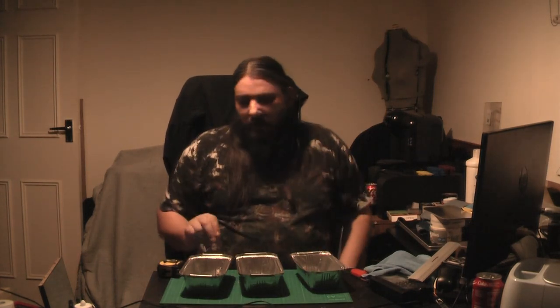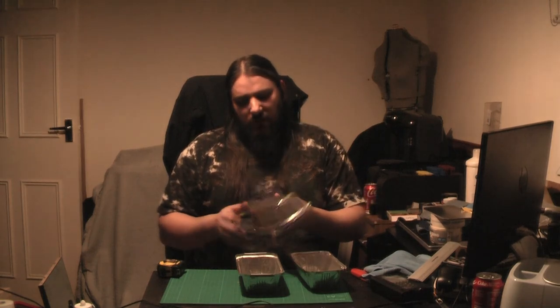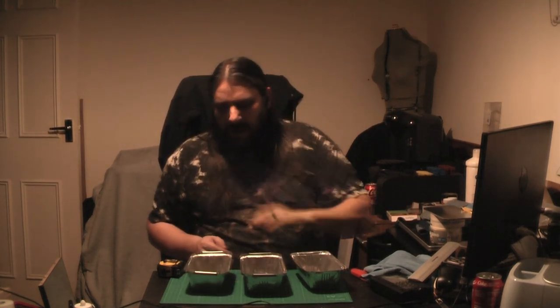Now, this isn't the ideal way of doing it. Absolutely not. It's corrugated. You've got a pattern on the bottom. This is not the way to go. You can mitigate that somewhat, but you will need to surface this because the base won't be perfect. The sides won't be perfect. Nothing about it is going to be immaculate. So if you do go this route, it is the cheapest route, but it's going to mean more labor. You know, if you can get glass and do that, that's fine.